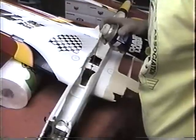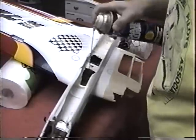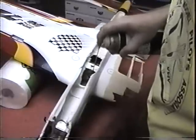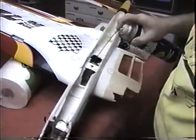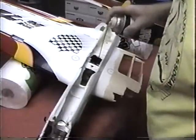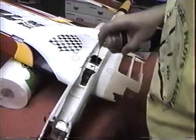Well, after all this mess, whew, boy, this is probably the single messiest job I've had to do in a long time. I want to get plenty of chain lube on here. Now, the original chain lube we put on here in 1993 is still there, and there's really not much play in the bell crank. In fact, there's none. And we have a removable bushing in the flap horn so we can add or deduct play from the system. Anyway, whatever life we get out of this for a very few hours investment in time, we'll hopefully have a serviceable plane again. Plenty of chain oil. I cleaned this all up, defluxed it, and the chain oil also keeps it from oxidizing too, as a cheap insurance policy.